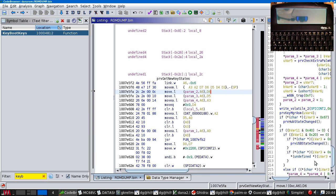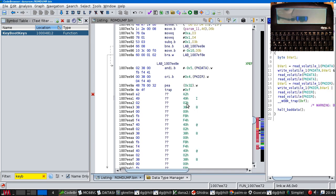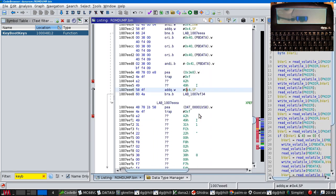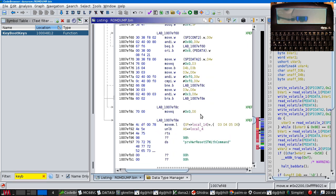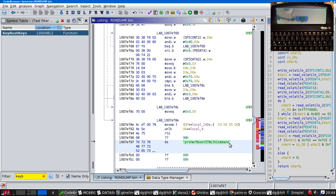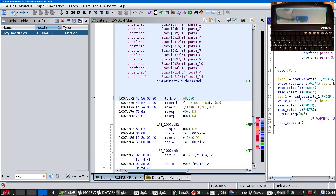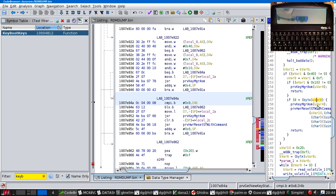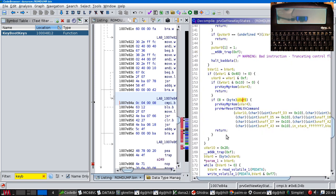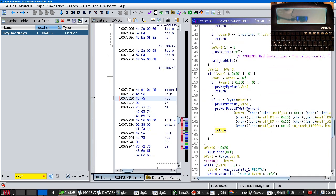See, there's quite a lot of this happening. Here's another thing, this one's poking lots of I.O. ports and SPI stuff, lots of delays. Oh, it's this again. I think we're looking at a different copy of all these routines. So why would this be resetting the microcontroller? Well, who knows, to be honest.